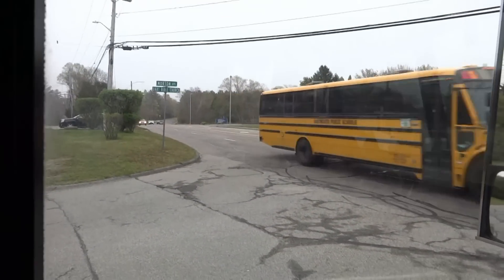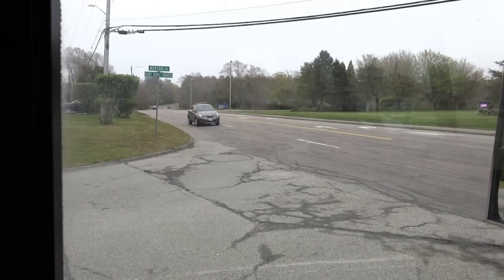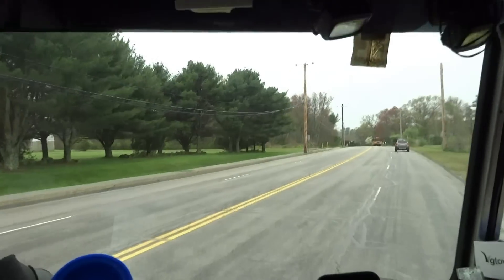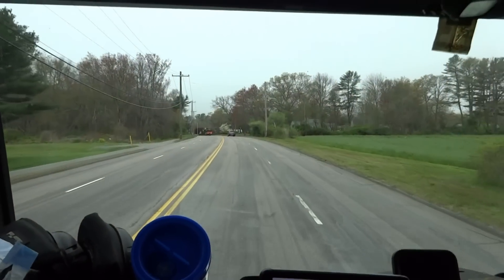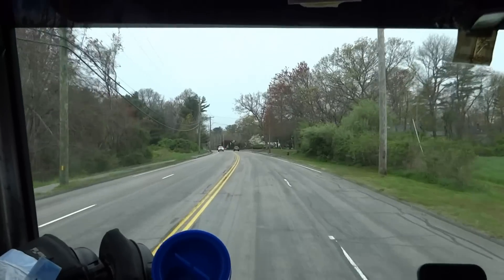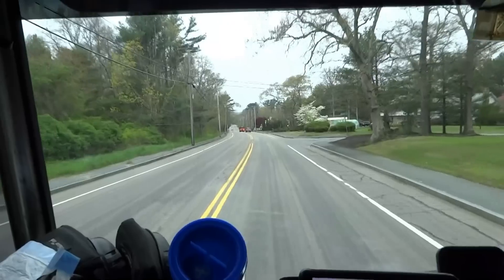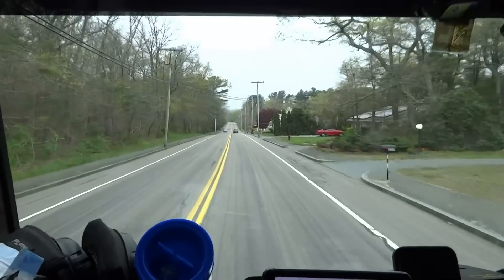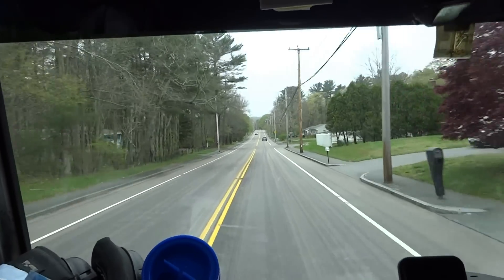Anything's possible, but I think it's an oil line in the ground and then I'd have to put an OSV. I don't even know where the oil tank is — I think it's on the other side of the cellar. On an old system like that, when I go there and I'm getting good oil flow I don't mess with the filters, but we're going to have to address it now. He's saying it runs for about a minute, then the pump starts winding and it starts coming on, off, on, off — that's an oil flow issue or a bad pump. We'll figure it out when I get there.